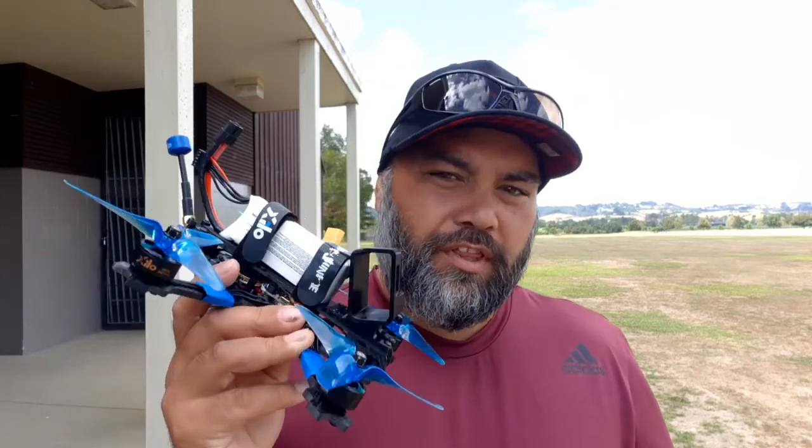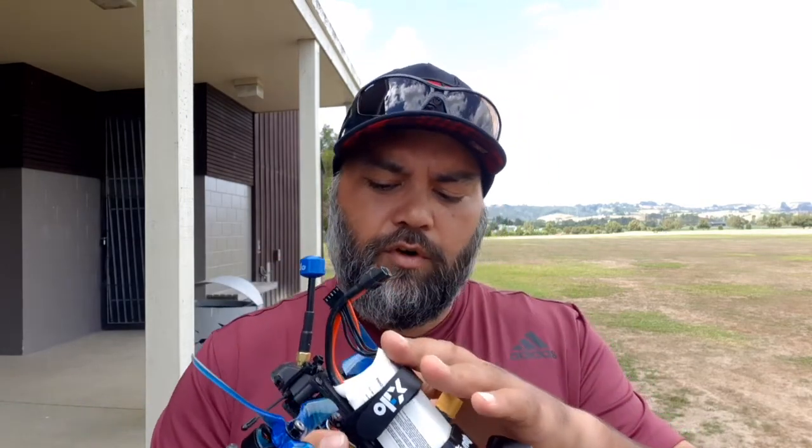I am back for day two of testing the Xilo Freestyle frame, and back at the park. Now, in the last video, the maiden that I did, I was having issues with the VTX. The VTX seems to be stuck in pit mode, but I think I found the remedy for that. I've downloaded the VTX tables for the Xilo controller itself, and I did it all at home, so let's take a look at that now.